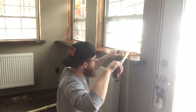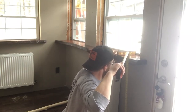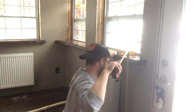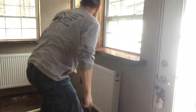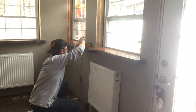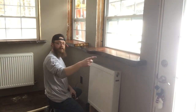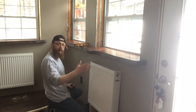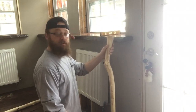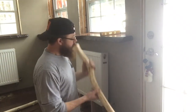I've got this level here, so I have to lift this countertop into a level position. We're looking at 37 and 5/8. I'll double-check all of these real quick to see if they're all running about the same — and they're not. So what that means is I'll cut my 37 and 5/8, get it in there, and then work on each one individually as we go. The challenge is how do I cut that out of this curvy stick? It's going to be tough.